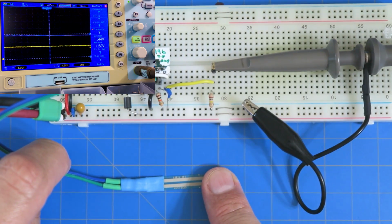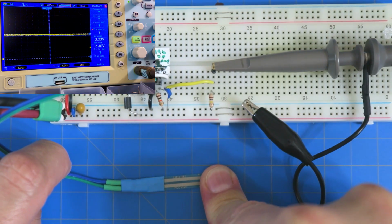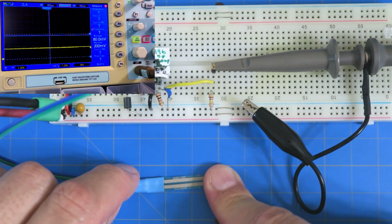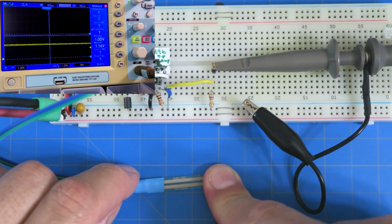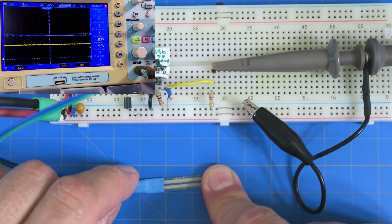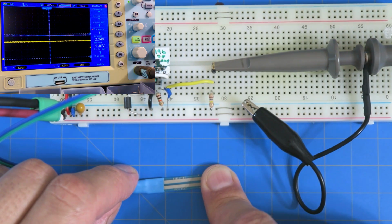So watch. Now I'm applying a good amount of force. Now it's getting kind of linear. Now I'm pushing really hard, super hard. I'm busting my finger. You can see my finger turning white. So we went up to 3 volts, 0 to 3. Remember, it's exactly what we said. You have a less dynamic range, but it's got a much more linear range in that smaller dynamic range, right? So that's where we'd want to work this thing.